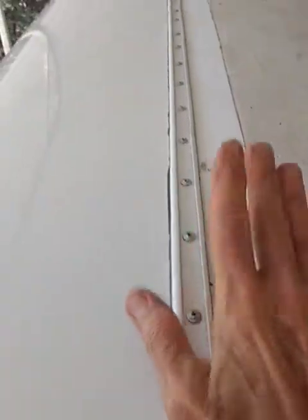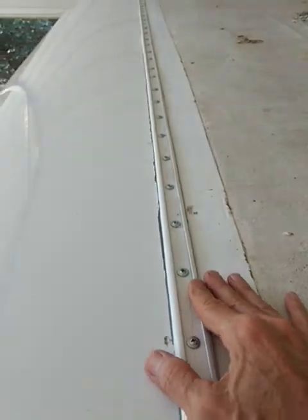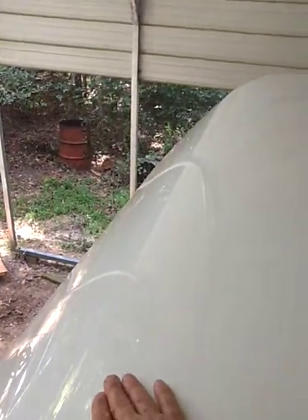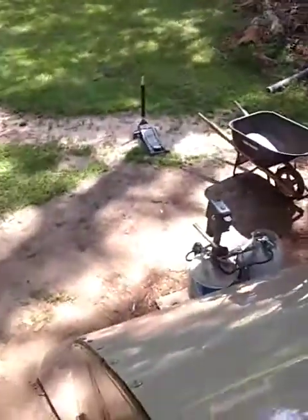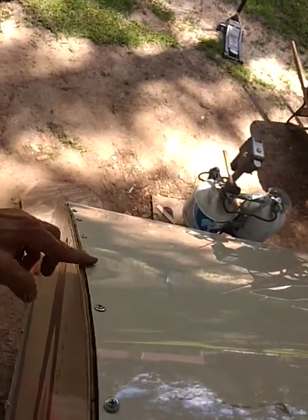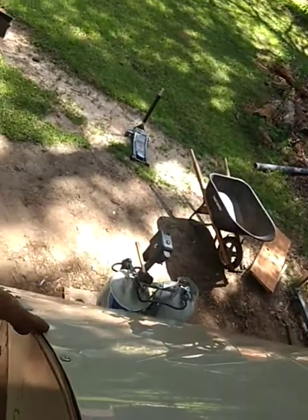So I've got this on. I used the existing rail that I had on initially and I'm reusing that. Just a hint: once you go to fold this aluminum over, you're going to need to put screws in as you go up first. Otherwise you're going to get a little cup in here. No matter how tight you pull it up here on the top, you're going to get a cup. So you're going to have to put screws in along the side — at least I haven't found another way.